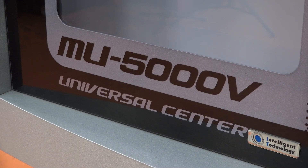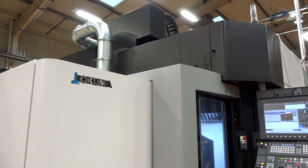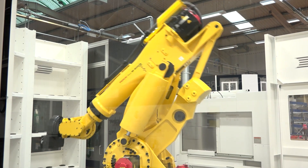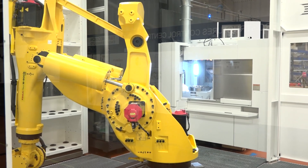Today I've taken the journey to Colne in Lancashire. I'm here at TNR Precision Engineering with Howard from NCMT. NCMT are very well known for turnkey solutions, and this Okuma MU-5000V — a 5-axis machining centre with a massive robot for automation — is a really big machine for these guys. One thing that really helped sell it was a technology called Turncut.